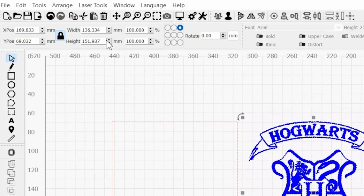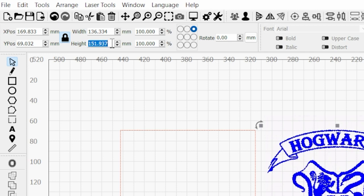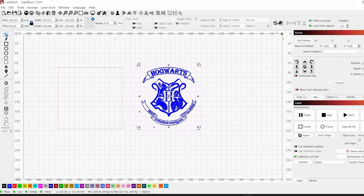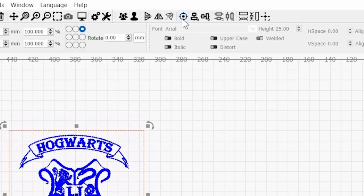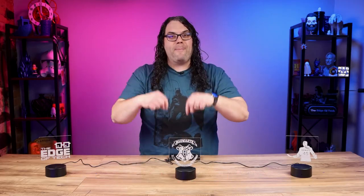Once you do that, go up to the top and look at your dimensions. You want to change whatever the biggest dimension is — whether it's width or height — to fit in your box. I know my box is 127 by 127 millimeters, so I'm gonna change the biggest dimension to 120, and I'll know the picture will fit inside that box and center pretty well. Hit Ctrl+A on your keyboard to highlight everything, then click the center button at the top to center the picture inside your box. Real quick — there's a step coming up that most people don't do but it makes these edge-lit signs look awesome. But first, if you're getting value from today's video please smash that like button and consider hitting subscribe.